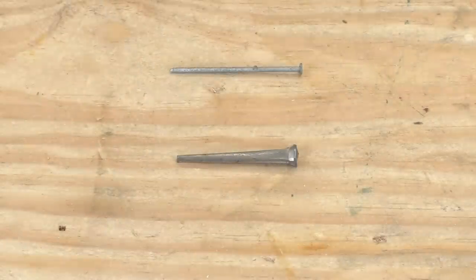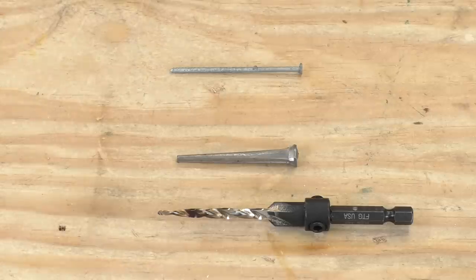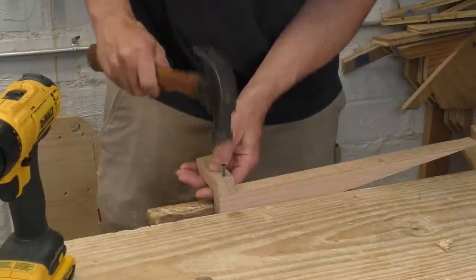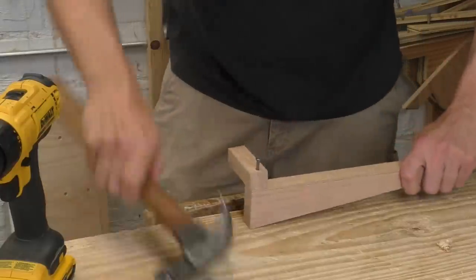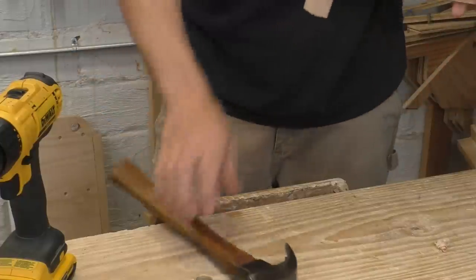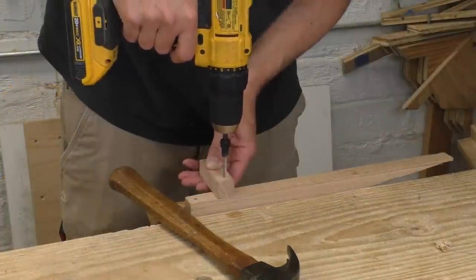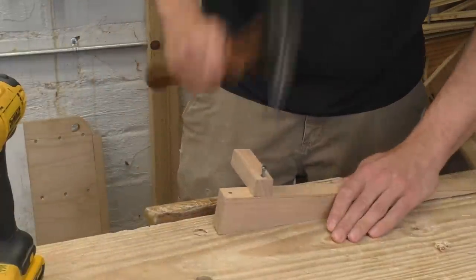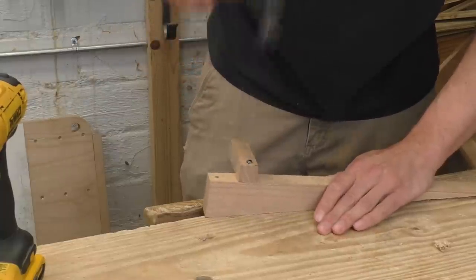These cut nails will need a pilot hole, and I recently discovered this tapered drill bit with a carbide countersink on the shank — I'll link to a set in the description. You can find the exact bit that matches the taper of your nails and it drills a little pocket for the nail head to sit in. But don't just go straight to the assembly — using nails requires a little testing. Put a couple of pieces of scrap together, drill through them, and drive a nail. These nails are wider in one direction and you need the wide part going along the grain to keep it from splitting the wood. Don't be afraid to ruin a few nails while you figure out all the correct sizes — you'll end up with a much better piece.